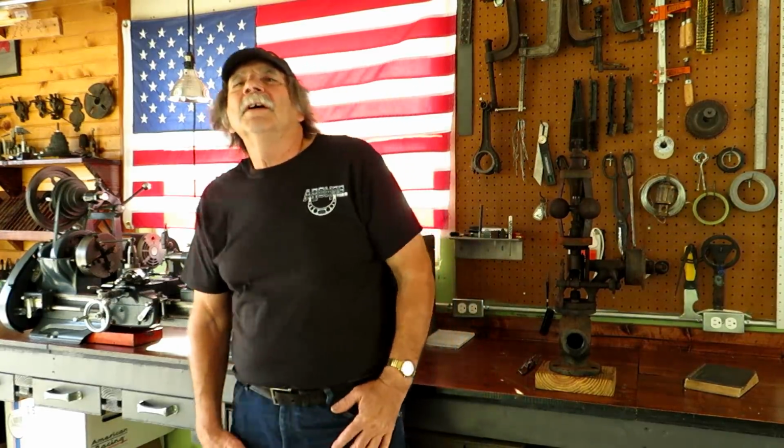Coming up, they have Florida Flywheeler Rob Moore from the machine shop over there. Kind of explains the deal with their line shaft that they've been working on. They've got a shaft set up to run a few machines, a drill press and a lathe and a milling machine and a big punch press, and they're running it with a 7 horsepower economy engine. And that engine, I bored and sleeved the cylinder for it in my New York shop last summer, and if you're interested you can see that on number 23 video.